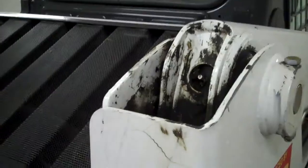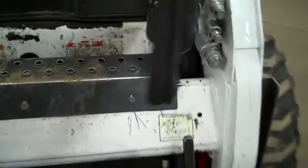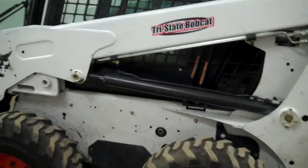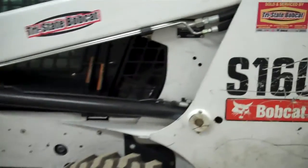There's a lot of grease on this machine — it's a good sign. People maintain this machine and it shows all the way through. It has not been punished like some machines have been. If you just wanted to plow snow, move in the woods, or do whatever — put the forks on there, it's a very capable machine. With a 1,600-lb rated operating capacity and right around a ton and a half tipping load.